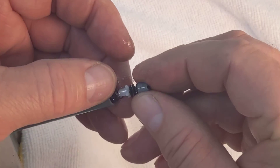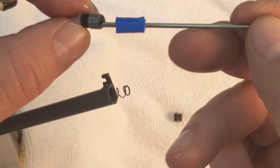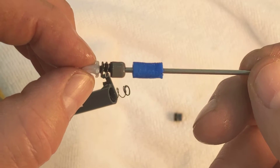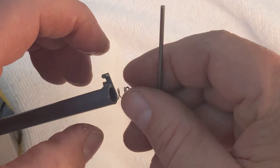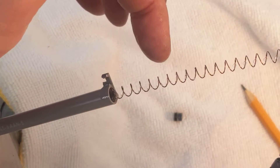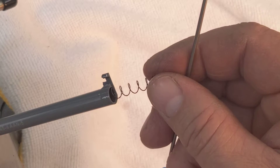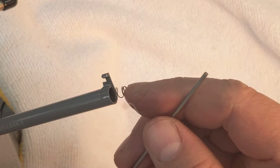And then there's this contraption here — this looks like some sort of valving. The rod would sit in there. Then there are these wafers that look like they're made out of rubber and a nylon piece, and that nylon piece is centered in the spring. There's a long spring coming out. I can see a lot of silicone fluid coming out — like a dampening fluid. I'm suspecting that if I pop that ball bearing, that's probably how they loaded this thing to begin with — with silicone. The spring keeps it shut.